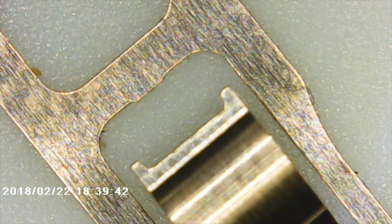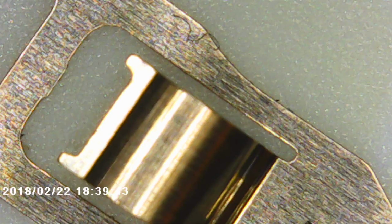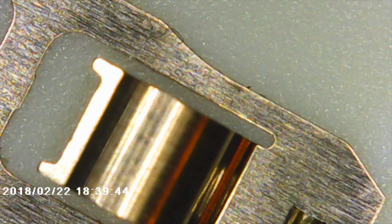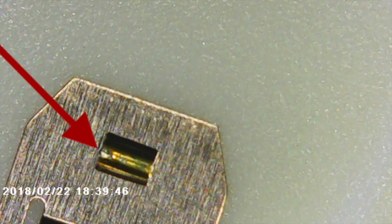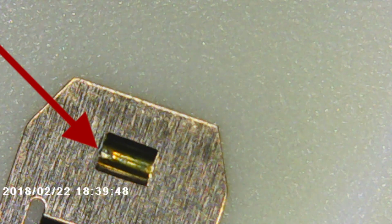Looking at where that makes permanent contact, there's definitely no silver plating along this side, but here is the on position contact, and you can see the little divot where it's hitting, actually hitting disturbingly off center, but that's another subject. And this is a separate rivet that's probably induction brazed on here, and it definitely looks like it is coated with something or another.